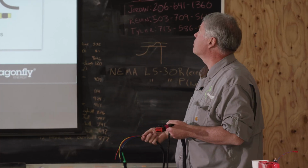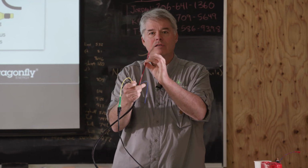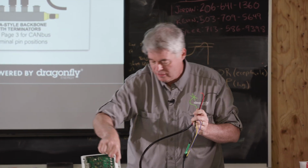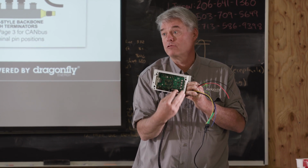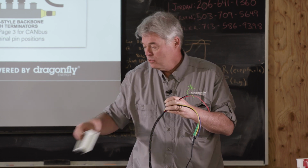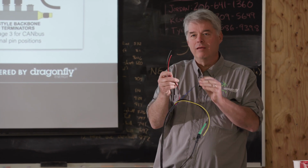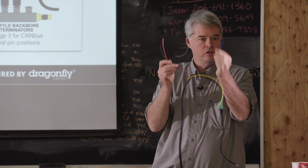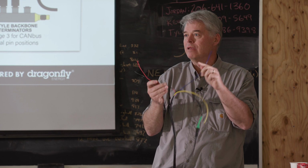The next leg is the one that goes to the alternator. The alternator has a red and black wire. This is the heavy current, the power side. The Wakespeed regulator actually has 2 sides to it. It's got a power side over here that powers the alternator, and a logic side over here that's the smarts, the little computer portion of it. So this red and black wire goes to the power side. It supplies the power that then gets controlled out on the field wire. The Wakespeed regulator decides how much of this ends up here, and that's the gas pedal, if you will, the field control on the alternator. That's how we manage the alternator.